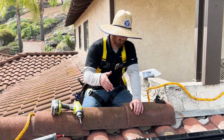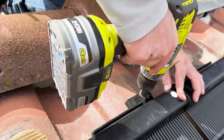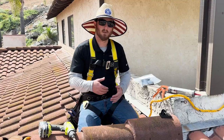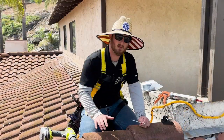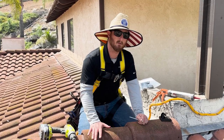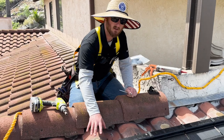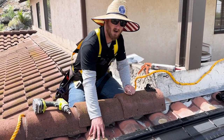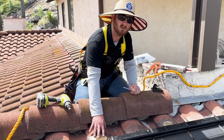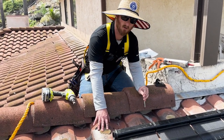Your next step is going to be taking your drill with a masonry drill bit and drilling straight down through the concrete tile. For this job, we have very limited roof space, so I'm using a six-inch lag screw. The reason I'm using a six-inch lag screw instead of the inch-and-a-half screw and anchor is because we have to use the top tile. Top tiles on tile roofs generally are not attached to the underlayment of the roof — they're more decorative. So with the six-inch lag, we're going into the underlayment of the roof to make sure the panel is secured.